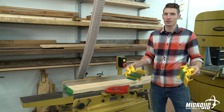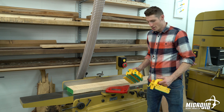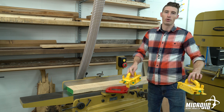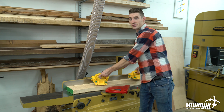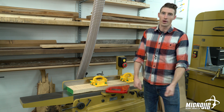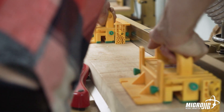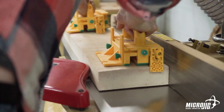Here I'm using two grippers and I've got them each set up a little differently so you can see the advantages of each configuration. First off, I have gravity heels on both of them. The reason I did that is because this is a long piece of stock and I'm going to use the hand-over-hand method to feed it all the way through the cutter head. And once it reaches the end, that heel is going to engage and push it through the end of the cut.